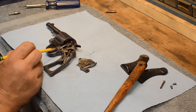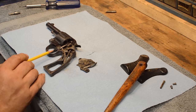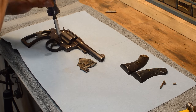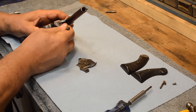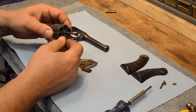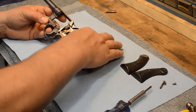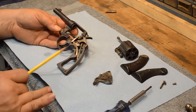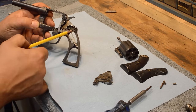Go slow, take your time, no files. Don't bring a file in here. All the metal that was supposed to be in this gun is still in it and you may need to keep it where it is. I'm looking for spring tension and checking to make sure it's on. This gun is just dirty and the action was really gritty, so the first thing we'll do is remove all this dirt. Let's get the cylinder out first. Press down on the screwdriver at all times because you want to maintain contact — this is not a race. As we're beginning to disassemble this thing, it's been a long time since anyone's been down inside this. But as you begin to get it apart, you start seeing flashes of brilliance — original bluing. This was an absolutely magnificent piece of hardware. It'll never look like that again; it was only new one time.